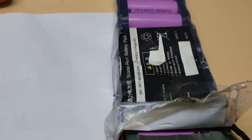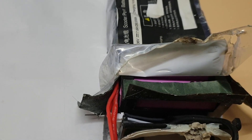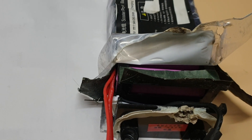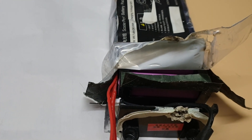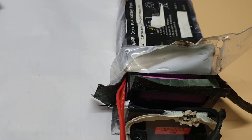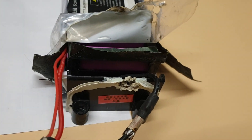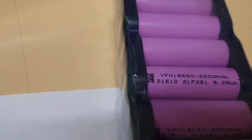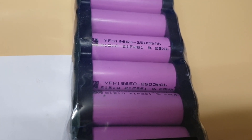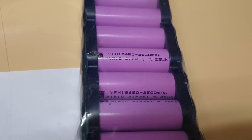If you use them in a good range, your BMS or controller will unplug at around 28 volts. I used some Canadian cells — the oldest I had — and after probably 1500 cycles, eventually one block failed. But these Chinese batteries seem to be okay. I have many batteries where the cells just failed though, like my son was using his scooter and it just failed.